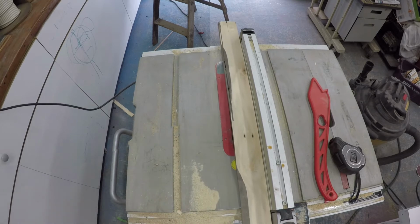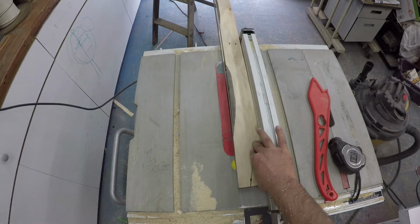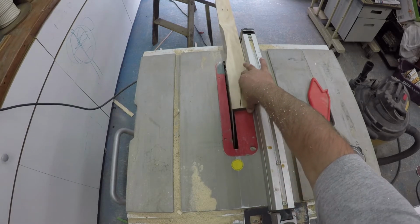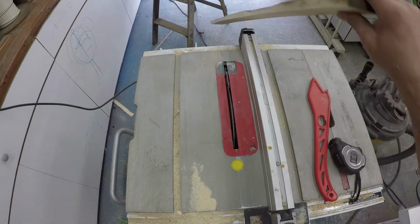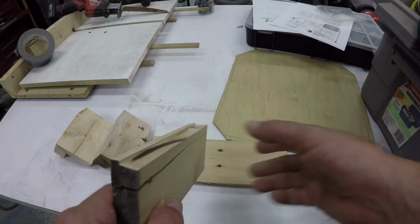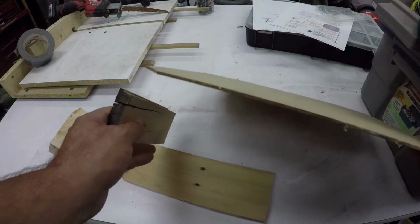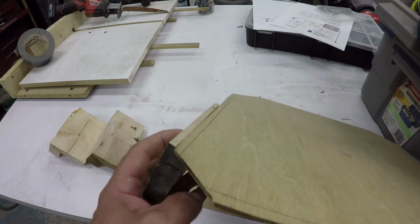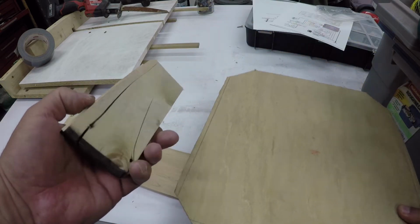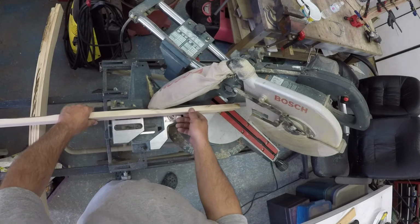Now I'm moving on to making the drawer. Again, I just used pallet wood, cut it to size, cleaned it up, and then I assembled the 4 corners with 45 degrees, and I created a groove for the bottom to be flush to it. That was all done on the table saw. That recycled plywood was the piece that would give the strength to my drawer.